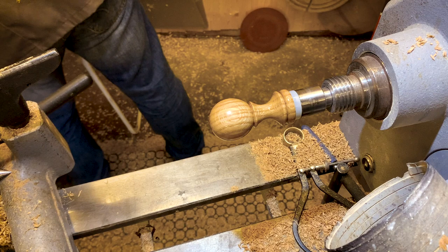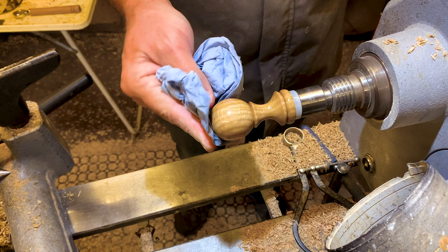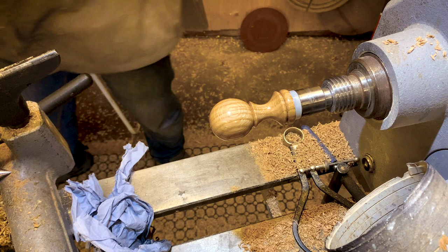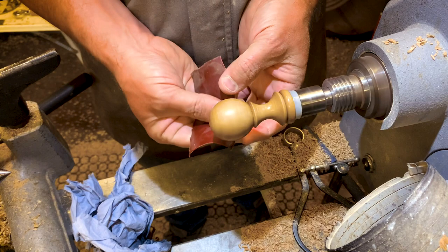If we talk about sanding sealers, they are used if you're going to use a lacquer. They're also going to be used if you use a wax, but they don't get used if you use an oil, because the oil is designed to soak into the timber. We're now going to wet sand that risen grain away. So you need to allow that penetration. Wax wouldn't be resistant enough to moisture and it would lift and tarnish quite quickly. So there are my reasonings.